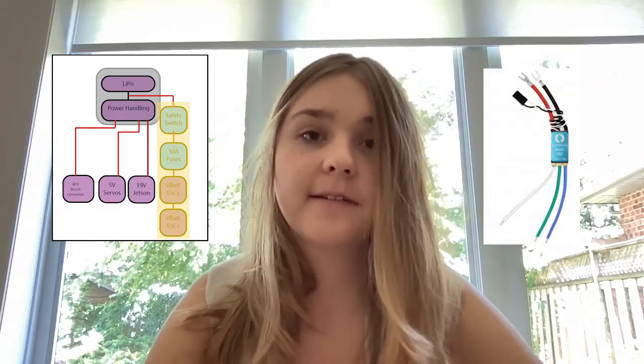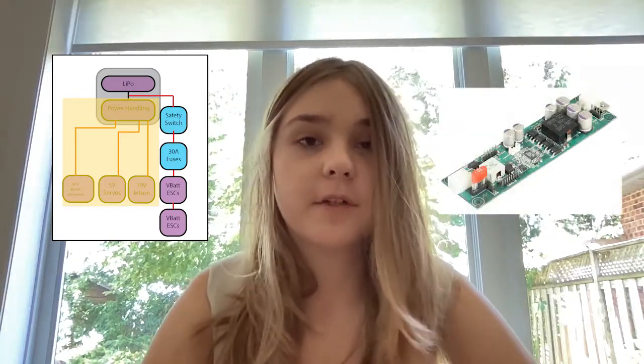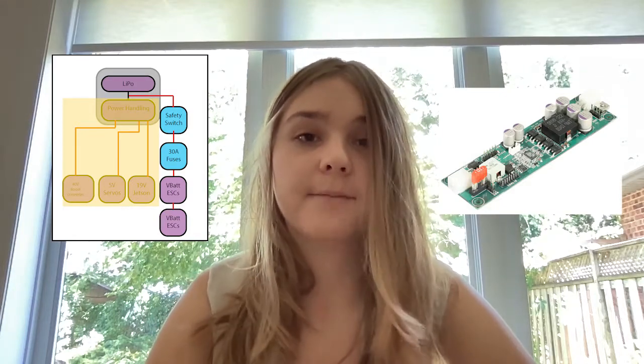This path is composed of 8 ESCs that are necessary to run the 3-phase motors for our thrusters. The branch highlighted indicates our low current device path, which includes the DVL, NVIDIA Jetson compute node, IMU, and camera. We isolate this path from the high current counterpart by regulating it through a commercial automotive voltage regulator supplied by Minibox.